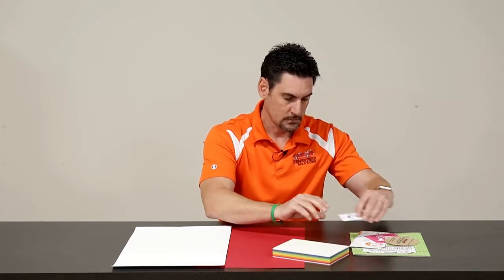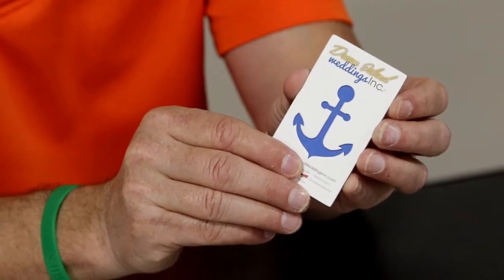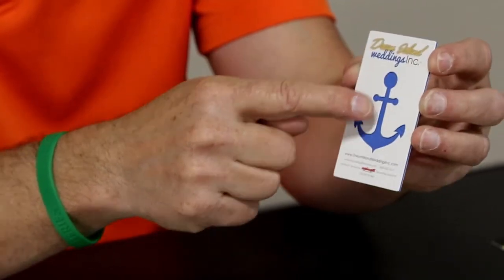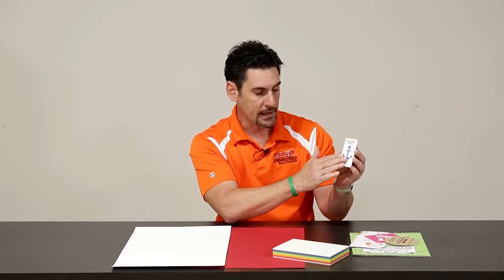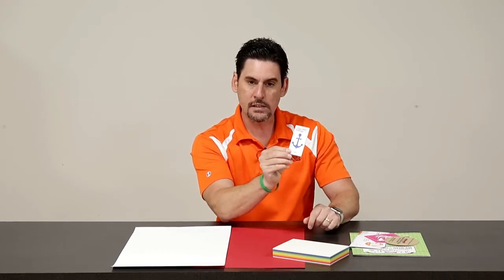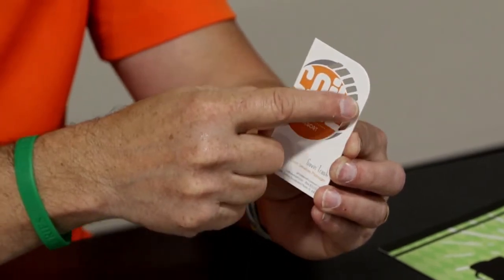Let's look at a few more products that we have. This is a very interesting piece. The customer actually used three sheets of paper, but one sheet — glue one-sided — they die cut and anchor out. So when the sheets were put together, you can see the blue center core, which is a glue two-side, actually comes through as an image on the die cut sheet. This is a one-sided die cut, or you can also have a through die cut where the sheets are put together, sealed, and the die cut is all the way through the card itself.